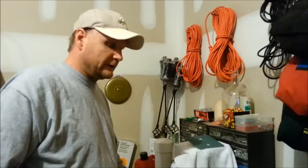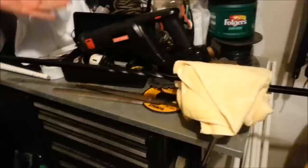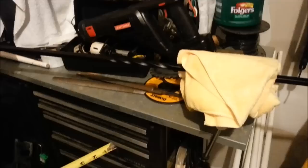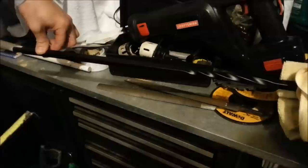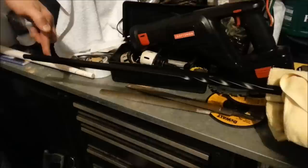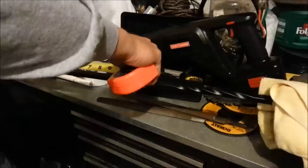Here's where we measure up the end of the spindle. Here's the long end that goes up into the top hole. You can either keep that or, depending on your stairs, you may have to cut the top or the bottom. We've been fortunate working only from the bottom as long as we've got the space where it goes into the top of the handrail. When you take your measurement, keep in mind it goes up in there. When you measure from the bottom of your handrail down to the bottom plate where the foot goes, make sure you've added the difference that goes inside.